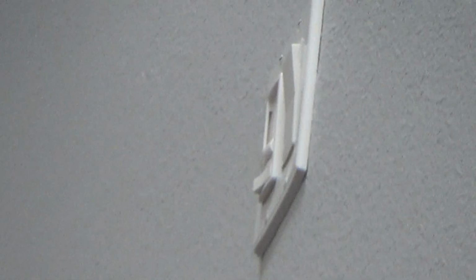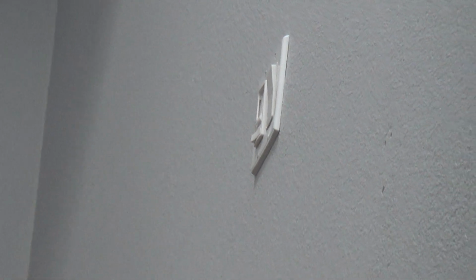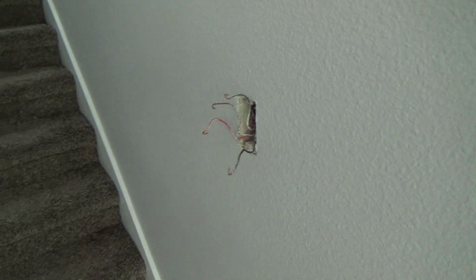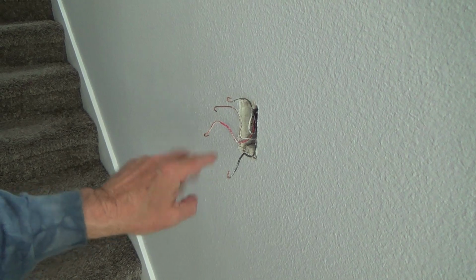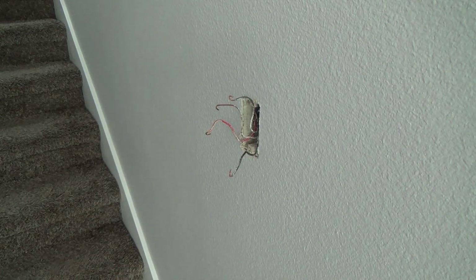Okay, since there's two switches right there, see? One is the dimmer that I installed before, but it's not a lit three-way dimmer switch, but that three-way switch next to it, that's not a dimmer switch, just a regular three-way switch, is a lit three-way switch. That makes sense. Okay, so now, before I do anything, I'm going to turn the power back on, and I'm going to figure out which one is the power that comes out of this box. That's our next step.